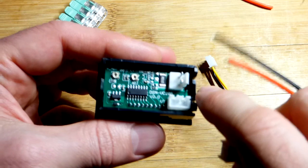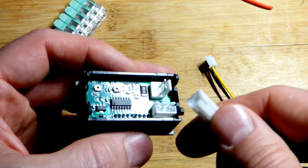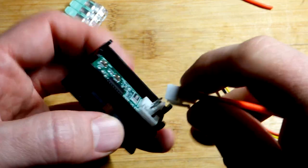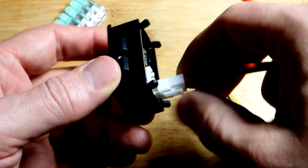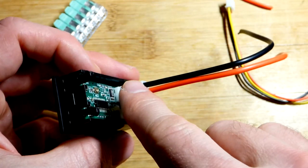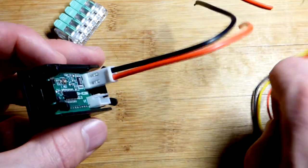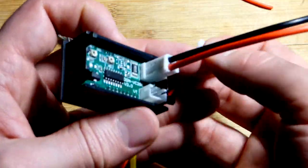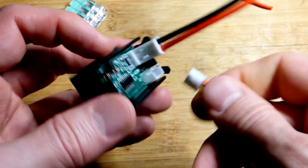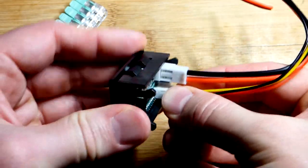When it comes to attaching the wires, there are a couple of trim pots for adjusting the voltage and current settings, but we're not going to worry about that. We've got these two spots right here. This little tab is removable and goes over where that little clip is. That's where we run current through the load — load comes from the positive supply, limits current, then sinks down to ground, the negative side of the power supply. These three wires have little tabs that slide into the slots.